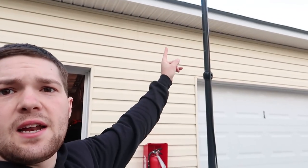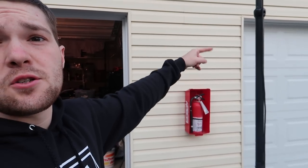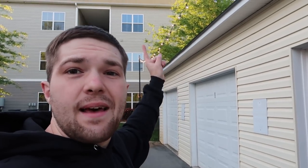As you saw, basically you raise it up a few feet at a time. Keep in mind, it's actually pretty quick to raise, if you saw. What I did was I raised this side up 2 feet to start, and then I was able to raise that side by 4 feet. So basically I went from 7 foot over here to 9 foot, and then I was able to go up to 11 foot on that side off the get-go. And then I just came over here, raised this one up to 12, and then went the last foot over there to go up to 12 feet, and they're up and ready to run.